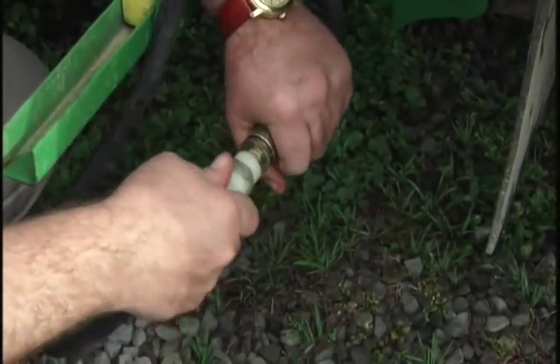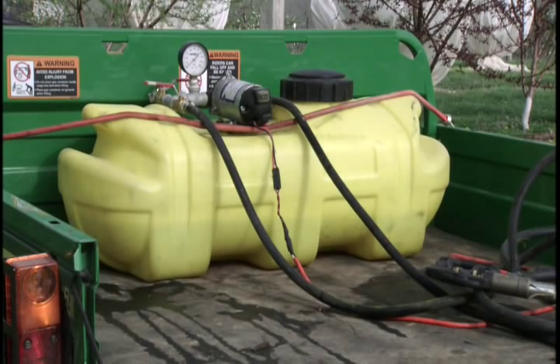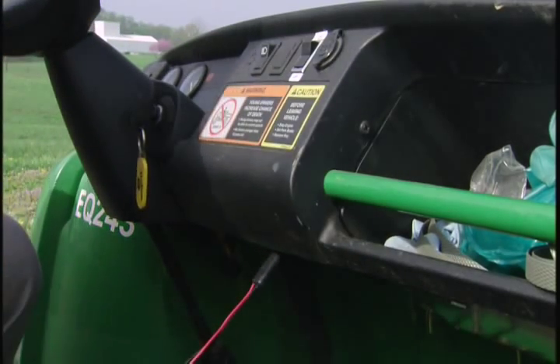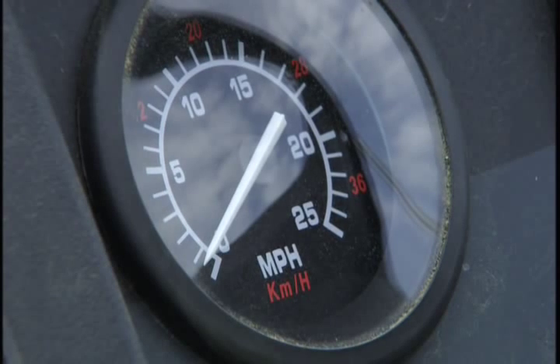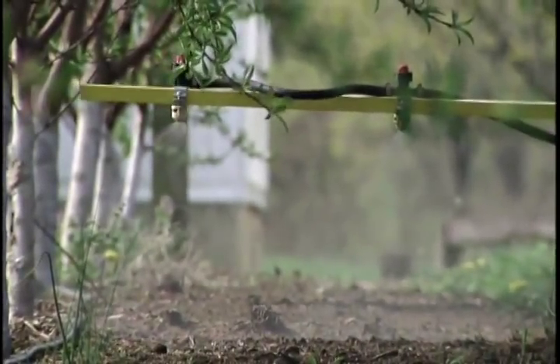A hose fitting allows the quick release of the boom when not in use. The 15-gallon tank, available at any garden or farm supply store, is fitted with a T-fitting to allow for herbicide sprays through the boom or the spray gun. An electric connection was set up so that an on-off switch can be installed near the driver's seat. A speedometer — a John Deere original product — was also installed to drive at a constant speed and deliver herbicides at an accurate spray volume rate.